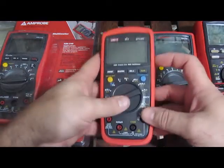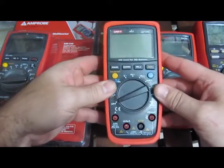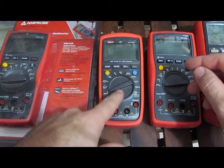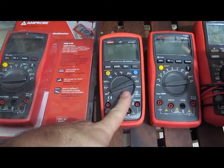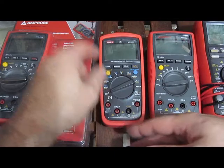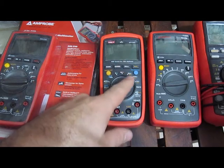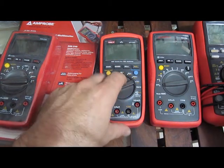Based on the testing that we just completed, I'd say this 139C probably is on par with the first one that I tested. I believe that the very first 139C probably would have passed all the first tests right along with the other meters up to the point where it failed. The fact that this one failed between 4 and 5 kV did not surprise me at all, based on where the first one failed. We didn't see the damage to this meter, but of course I stopped the testing as soon as I'd realized that we had damaged it.